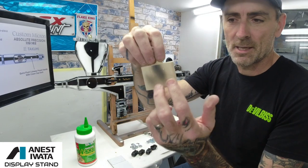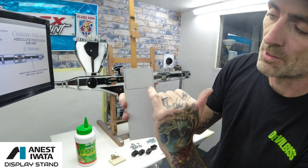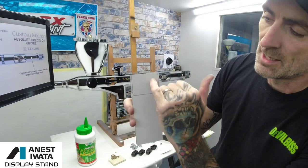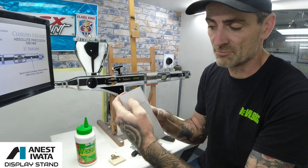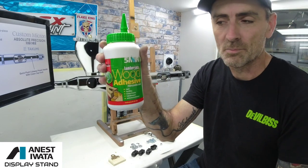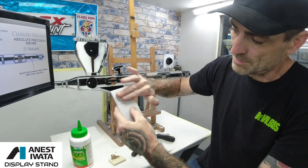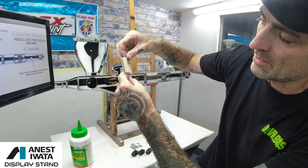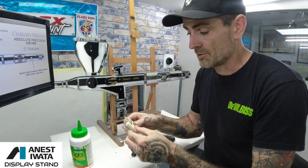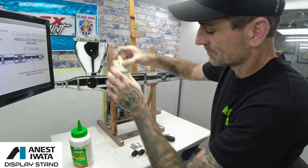And the way I mounted this piece, the timber to the aluminium, if that's the back of the aluminium, I've got a scalpel and gouged into the aluminium crisscross and basically keyed that surface up. So that's really, really coarse, you can hear that. Got some of this glue, which is a solvent proof wood adhesive, and this stuff bonds to anything. Dropped a bit of that on there, and then placed that onto the aluminium, weighted that down 10 minutes, and that's gone off and dry. So that's basically what you're looking at the back of this brush, is like that.